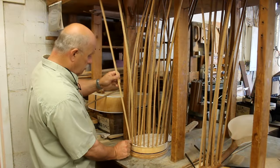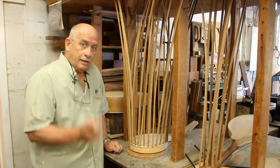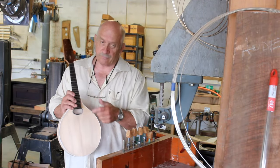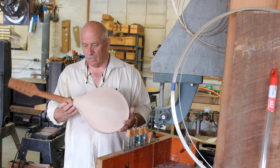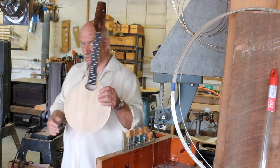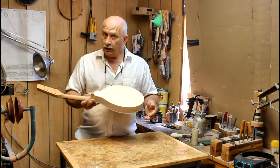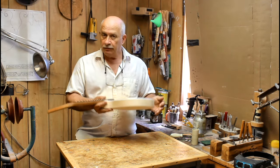That glues this back on - which is about the last major significant thing that has to be done, besides final sanding and sizing, before this thing is ready for the stain and whatever comes after that. Pretty big deal. That same mandolin has now been sanded all over really good with 220 grit paper. I've wet everything down to raise the grain and sanded it again, so this one is pretty much ready for the next steps.